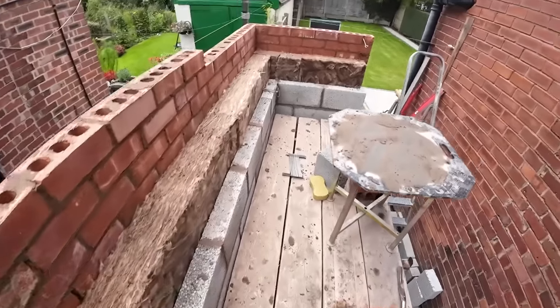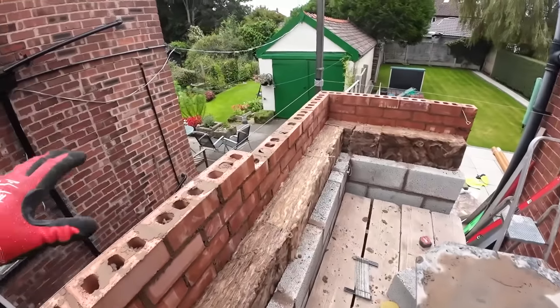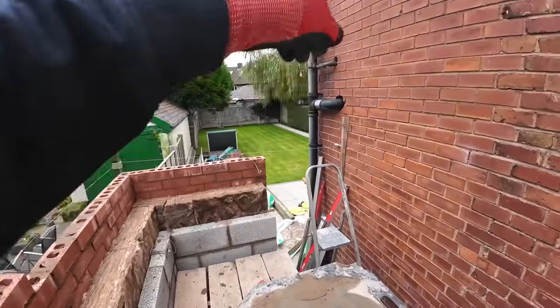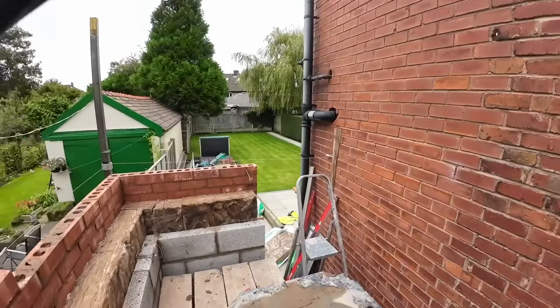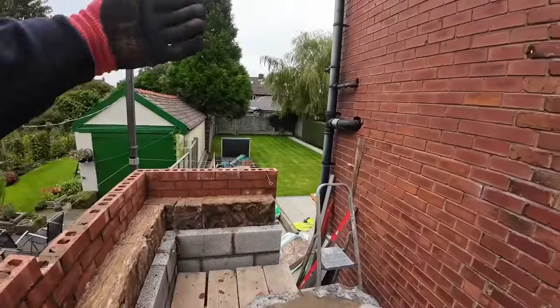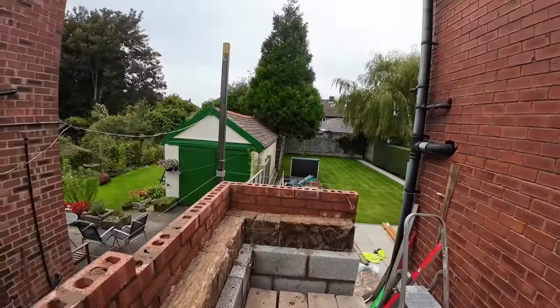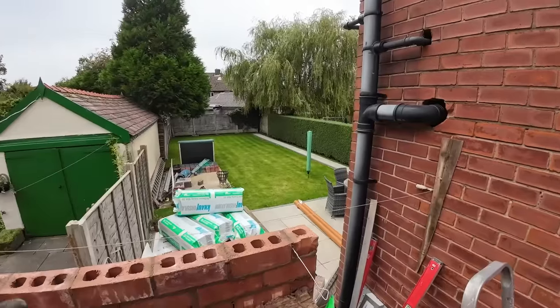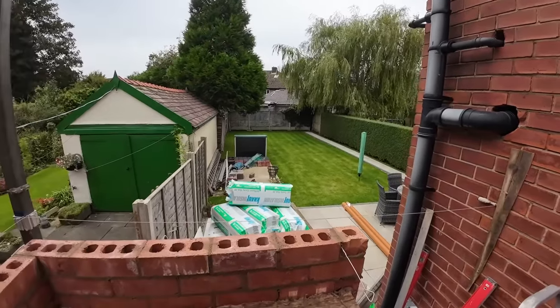So there's still plenty of work to do on this yet. There's all the extras to go up there yet, the extra 3. That course to finish off, lintels to break out, cavities to cut out of the wall because the inspector wants the cavity continuous, so there's no cold bridge. I hope you're picking this up because of the wind. Then obviously the pikes, which we can't work out, so we've got our wall plate height.